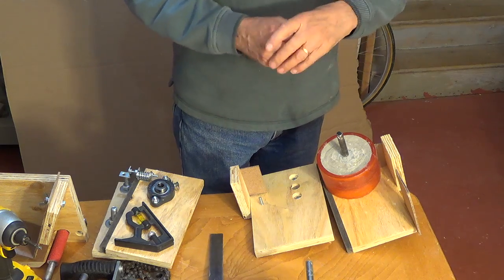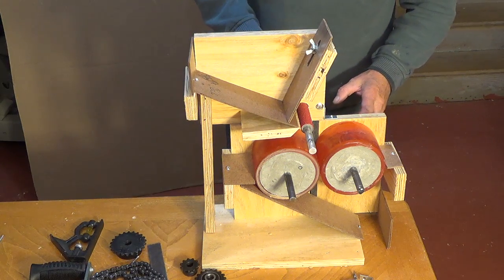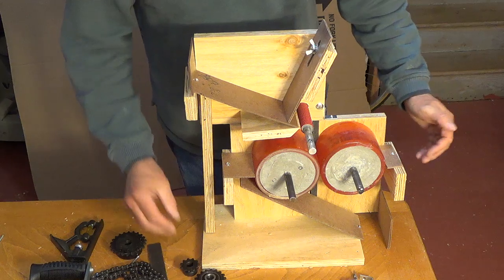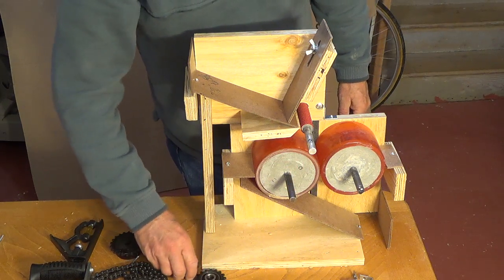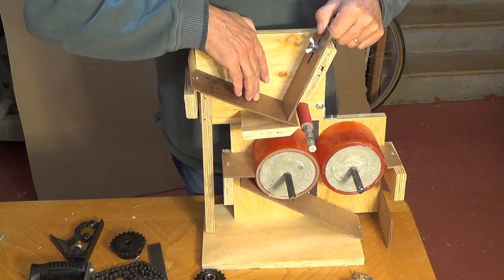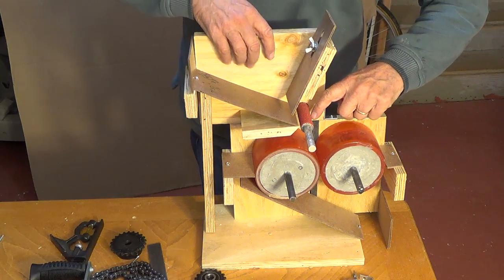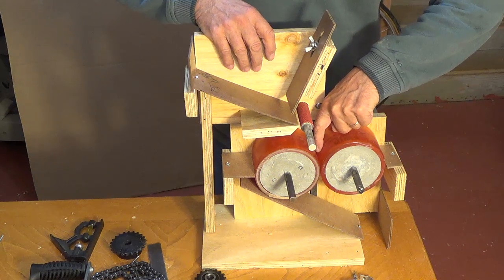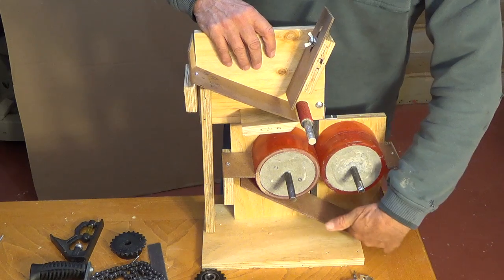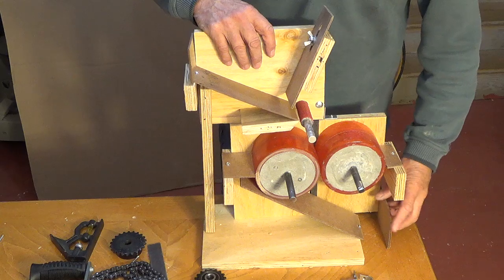I've taken the unit and reassembled it a little bit. Now we've got a true cutaway. There would have been side walls here with the various sprockets and chains. You put the rice in here, open up this gate, this would spin, the rice gets drawn over the top and drops down in between these rollers. Then these rollers are spinning — there's a shear effect in here — it drops out, hits this slide, and comes out. We've made this so that you would put this over the end of your table and then have a fan blowing on the rice to get rid of the husks.